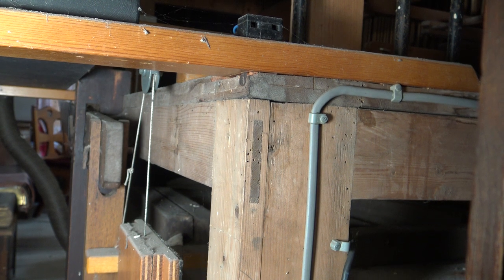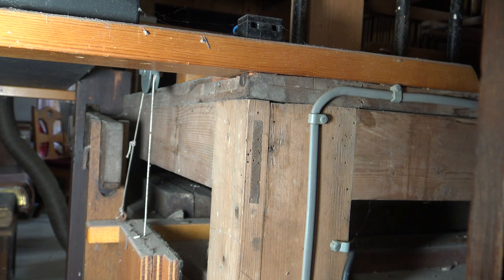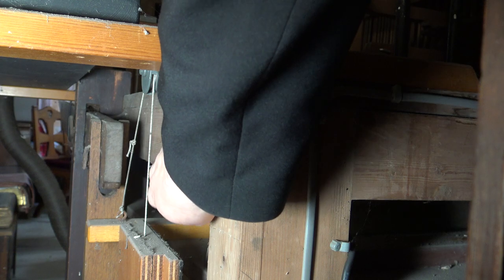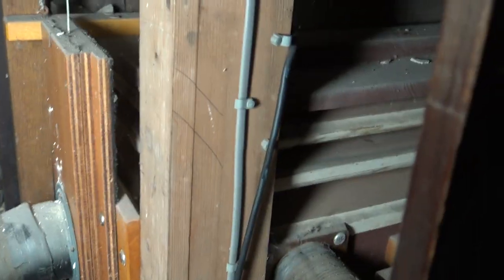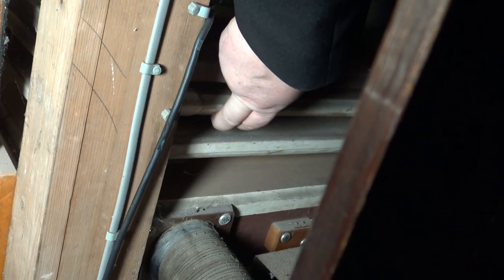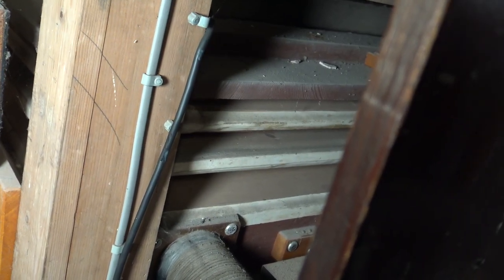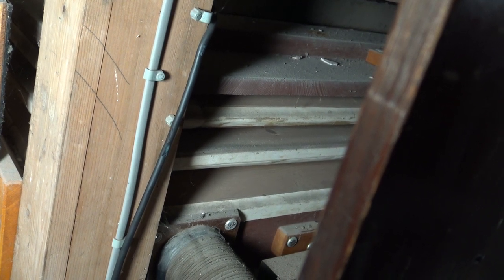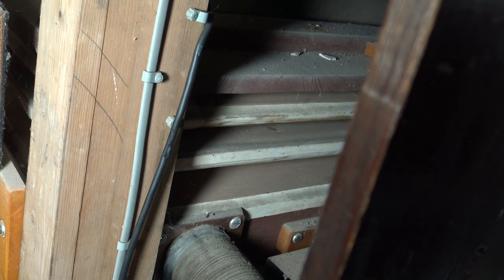So the bellows has risen, and it's cut the air supply off, we can actually see that. Like the one we're going to work on, it's a double rise bellows. So you've got the upper one, the floating frame, and the lower one. You see how that bounces around so easily with the 3-inch water gauge of pressure that it'll be set to.